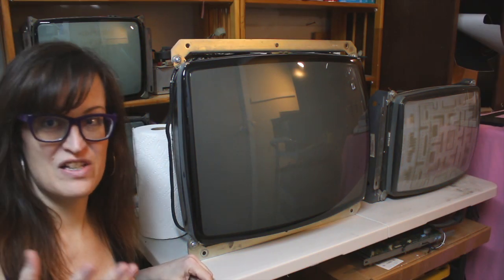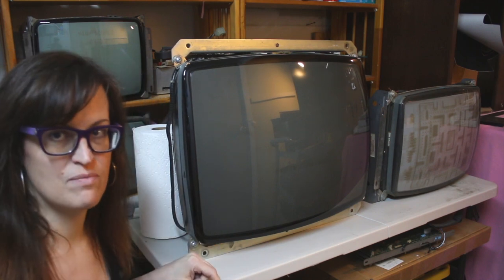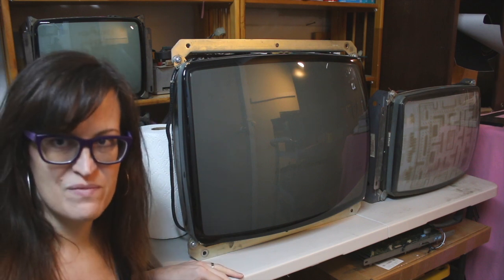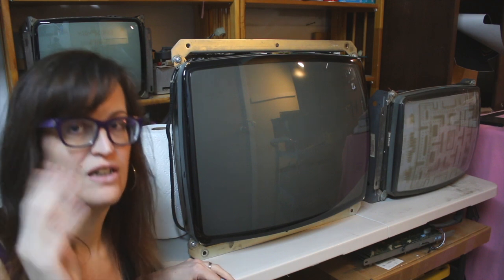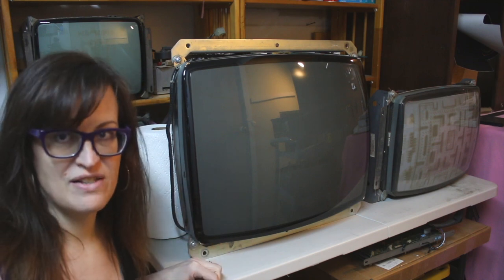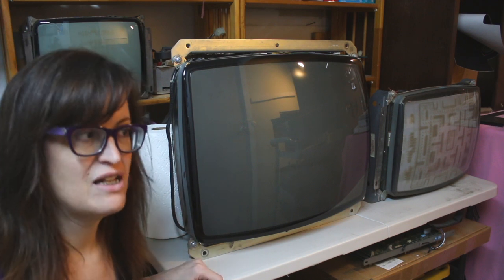Welcome to my monitor stash portion of the workshop. This is a 25-inch CRT — not the original monitor for the Simpsons, but the one that was in mine. I've totally rebuilt it, recapped it, and now it doesn't work. I don't think there's any problem with the tube — I think I've screwed something up with the chassis, because it tries to work but there's no glow and no picture. The board also has a sprite glitch we're trying to get fixed.